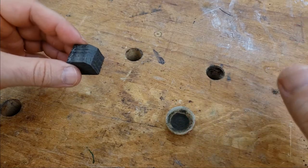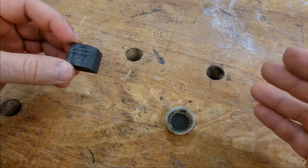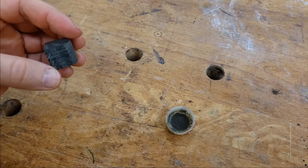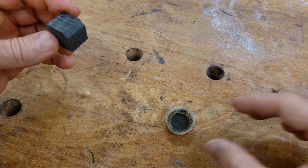For glue I'm going to be using epoxy, but I also sanded a little bit of black wood to give it a little color in the epoxy so that it doesn't look like that translucent color. It looks more natural — something like spalting or part of the wood, like part of the bark for example. That's why I do this little bit of coloration. The glue is a five-minute epoxy but I usually give it about an hour or two just to have everything settled down.